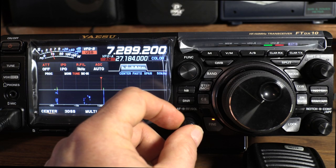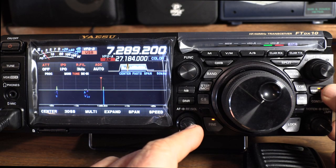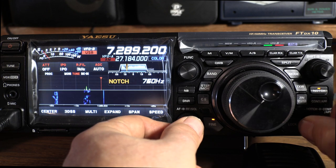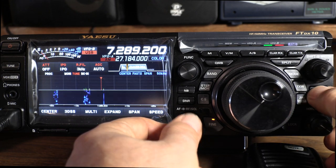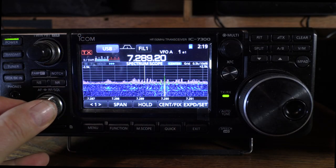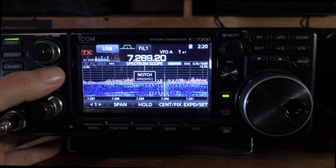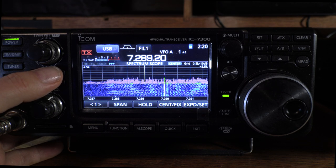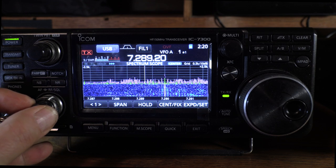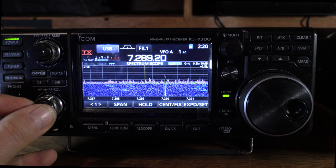Let's take a quick check of notch performance — just a carrier from a broadcaster at the top end of 40 meters. The Yaesu has a manual control if you want manual control, and having that graphic representation is rather keen. Both radios have automatic and manual notch, so you can hand-dial it in or have it done automatically. The automatic notch will knock out multiple carriers at the same time, and you also have width-of-notch adjustment on both radios.